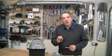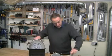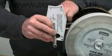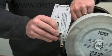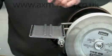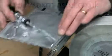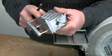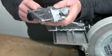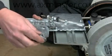So let's give it all a go, and I'll show you just how easy it is to set up and use by sharpening this rather tatty 10mm bit. The first stage is to use this template to set the universal support about 40mm away from the stone — slide into place, move in the universal support and lock up tight. Then fit the base plate; the Tor-lock makes this very easy to get secure. Mount the guide plate — the lubricant on the slide makes it so smooth to move from side to side. Now fit the drill bit into the holder with the beveled edge pointing towards the wheel. The necessary protrusion is set using the stop on the guide plate, so just make sure it is locked securely.